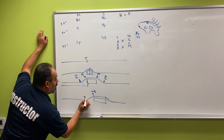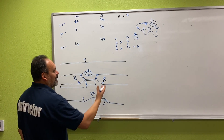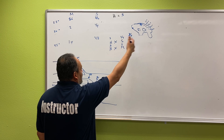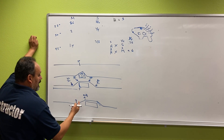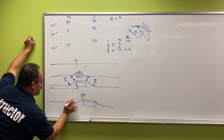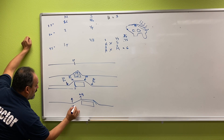To get Mark B, I'm going to deduct six inches from my 24 and three-quarters. That's the nice thing about the 30-degree bend — very easy math, you can do a lot of it in your head. Quarters and times-two you can add in your head; it just doubles it. So if my height was three inches, I go back six inches, and 24 and three-quarters minus six becomes 18 and three-quarters.